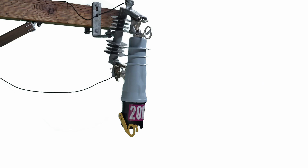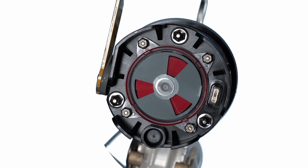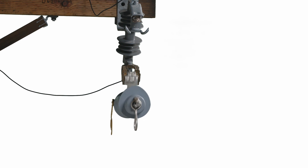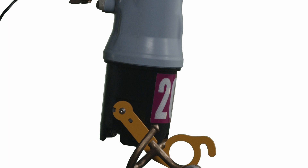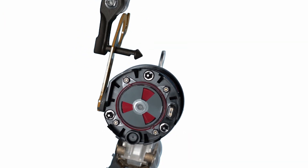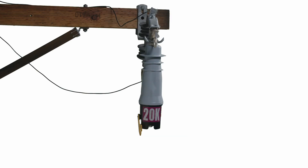The interrupter must be closed in the cutout mounting with sufficient voltage present for at least 45 seconds before the VacuFuse 2 self-resetting interrupter can be closed by moving the lever to the closed position. The VacuFuse 2 self-resetting interrupter will drop out of the cutout mounting after one minute when the VacuFuse 2 interrupter is in the open position and the ready-to-close LED is lit. To open, pull the yellow manual operating lever down firmly using the straight prong of the talon tool or a distribution prong. Remove the tool right away. The vacuum interrupter will open and the position indicator will show the green target. After one minute and 45 seconds of the VacuFuse 2 interrupter in the open position, the unit will drop out.